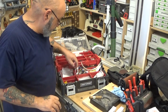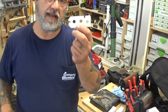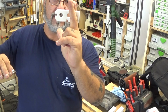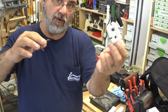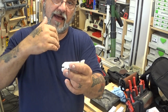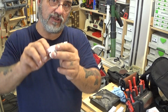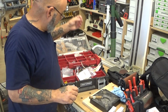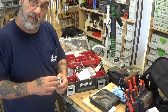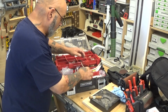And then the gasket, very important. This is for the ones that have two sensors and the igniter. Take this side out. That's the double, and then this is the newer model. So I carry both, but this here will go through this, and the plate will go on that, and that makes the seal between the burner housing and the outside. So very important, a piece of Scotch-Brite. Electrical tape. Have some electrical tape. Okay, O-rings.